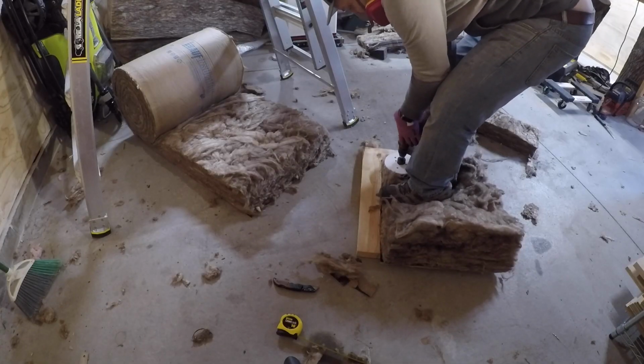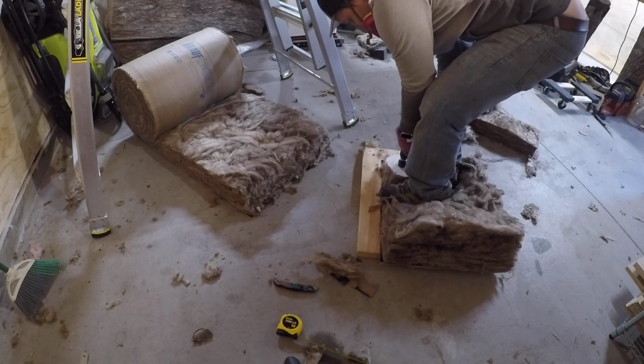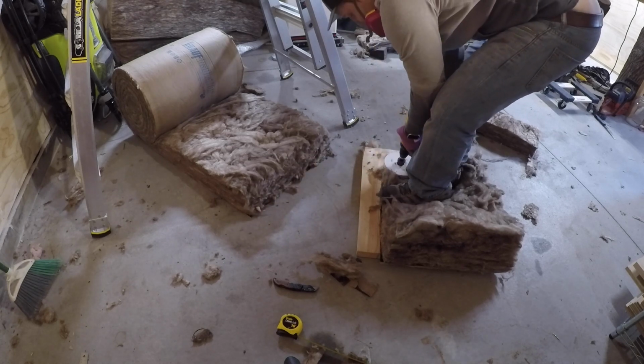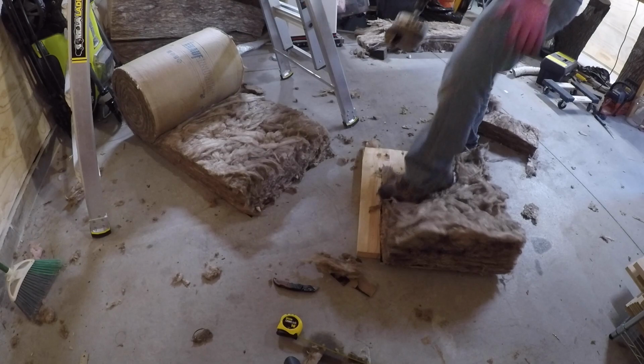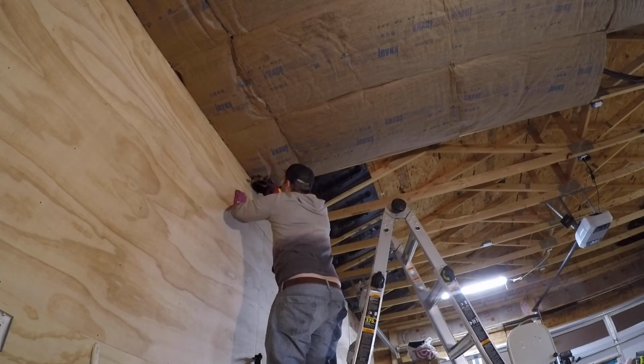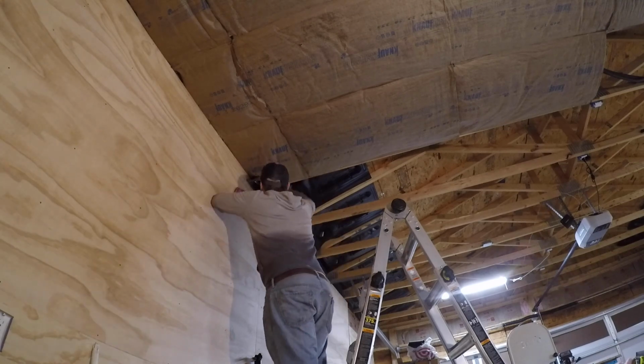For the final piece of insulation where the duct entered the room, I tried to be clever and used the hole saw from earlier to cut the circular shape needed from the insulation, and it actually worked better than I thought it would. I did need to tug and tear the paper a bit to go fully around the duct, but otherwise it worked just fine.